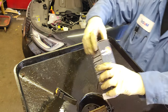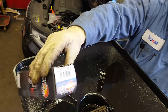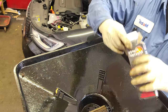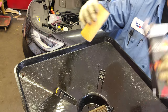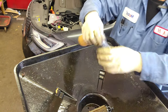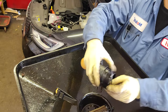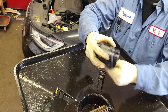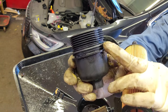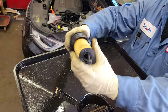I'm gonna grab the new one — made by Parts Master, it's WL61010. It comes with the cartridge and the o-ring. The o-ring goes right here. You don't put it up here because the thread is there — you put it in the next one down below.